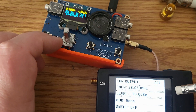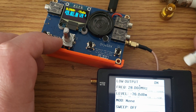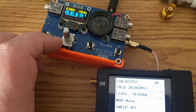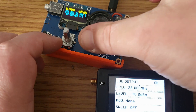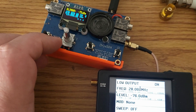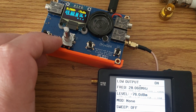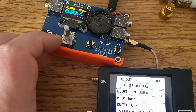Let's test the receiver quickly. The true SDX is now at minus 112 dBm noise floor. I'm injecting a signal at minus 76 dBm, switching sidebands — that's the level we get. Setting it to the right frequency in CW mode and as you can see, minus 76 dBm is clearly received. Receiver is also working great.